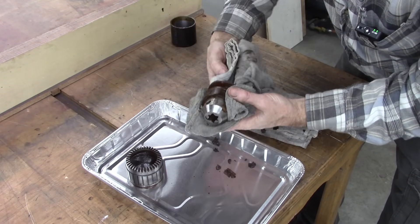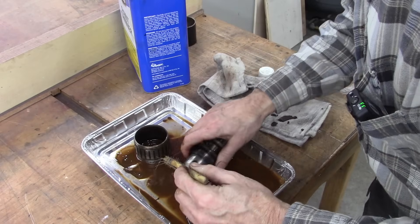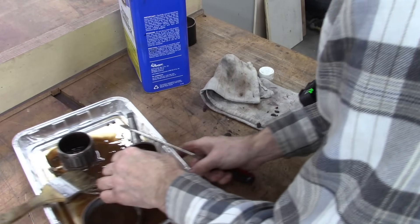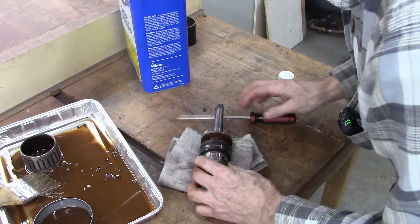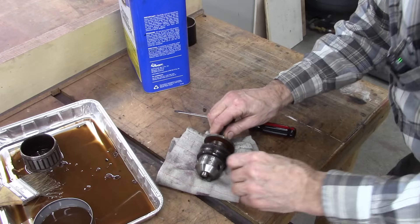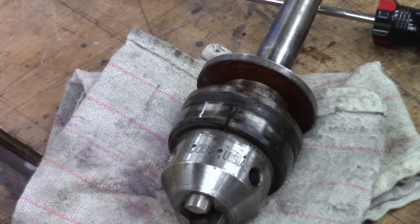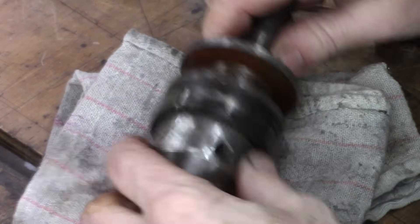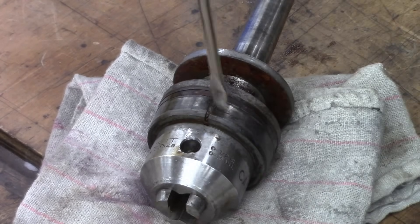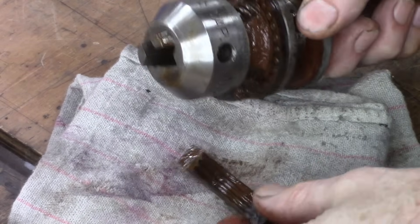It's no wonder it was rough inside. Here's kind of an amazing part about these chucks — hopefully it'll come apart easy. Right here — I'll zoom in on that, hopefully you can see it — right there, there's a little line. There's one on the other side of it too. What they did is they made that piece right there and they broke it in half at that line. So if I tap that it should come up. See there? It's a two-piece.